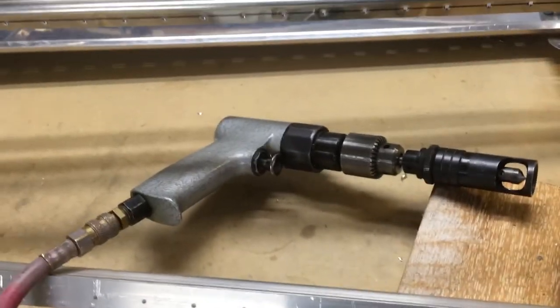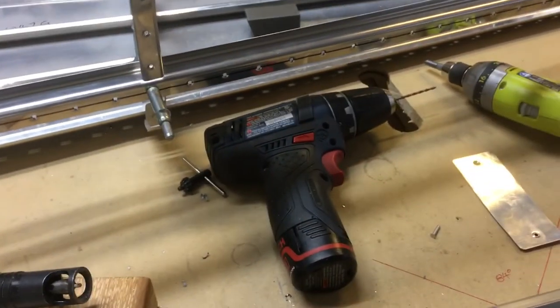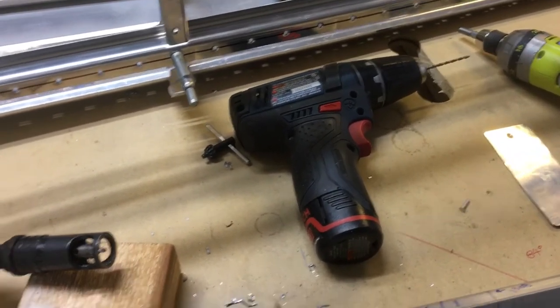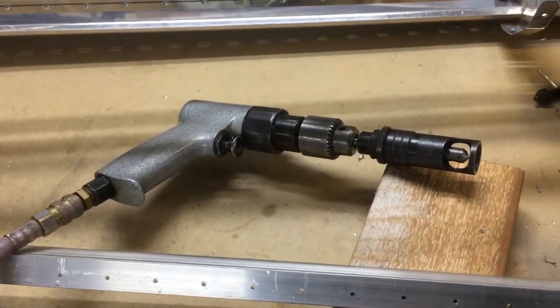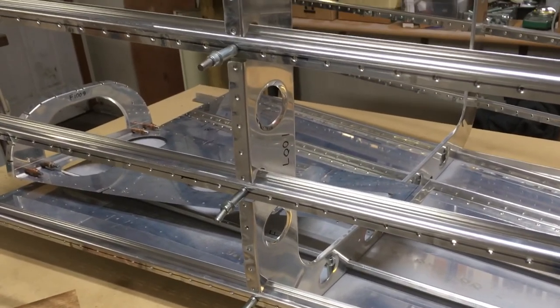I like to use a small, lightweight air drill so I can feel things even better. I've tried it with a battery-powered drill, and turning it really fast isn't a huge advantage here — you don't have to turn it that fast if your drill is controllable. I think that's it. We're getting there — we're going to start deburring and dimpling skins today. See you later.